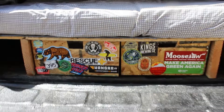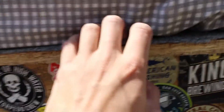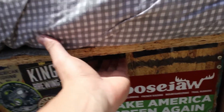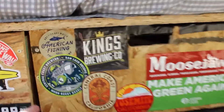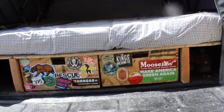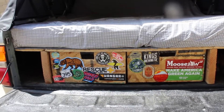One drawback of this setup is that the piece of plywood in the middle is just being held by this rail. When you're actually sleeping on top and try to pull a drawer out, this board has give, so if someone's laying right here it just gets jammed. The person has to move over to release it. I'd probably recommend adding another support right here to keep this piece up so it won't get stuck — I just didn't do that because I wanted the extra inch of space, and figured I could struggle a little. It wasn't much of a problem for me.